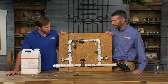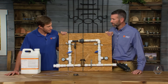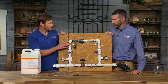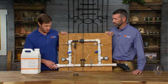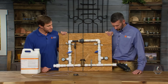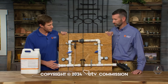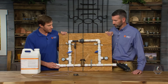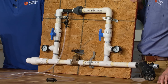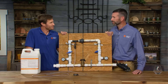Well, that's really interesting. Anything else folks should know if they wanted to give this a shot? Yeah, just let us know — we can help you set one of these up. The key for these is sizing it for how big your space is, because it won't work right if you don't have the right pressure and flow rates. You also have to have backflow preventers by law so that the fertilizer doesn't get into the water system. There are a lot of nuances we can help you navigate. But once you get one of these set up, I think you'll really enjoy it — they're fairly inexpensive because they last a long time. A setup like this will be a couple hundred dollars. Well, Zach, thank you very much — really interesting information that hopefully folks can use, and I might give it a shot at my house.